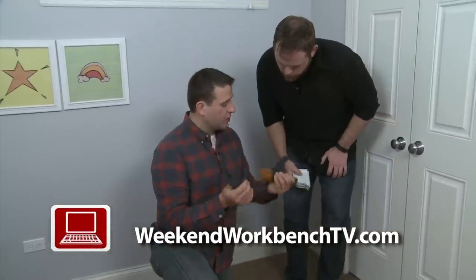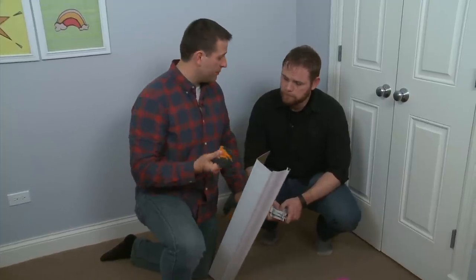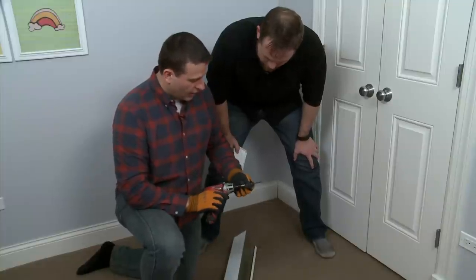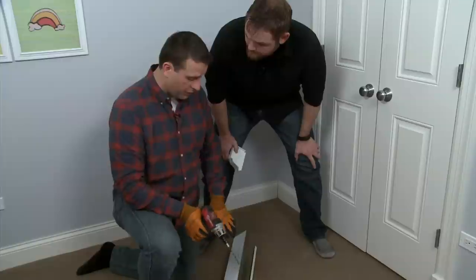So Ryan, I brought some gloves today because when you're working with aluminum or any type of metal, there are some rough edges on here that will be covered up by the caps. But until they're covered up, let's put some gloves on. If you're concerned about sharp edges, you can buy a vinyl gutter — I just think the metal looks nicer. So the first thing we're gonna do is create a couple of mounting holes on the back of the gutter. I have a small drill with a black oxide drill bit, and this is gonna easily go through the aluminum.